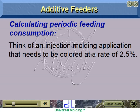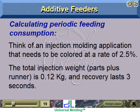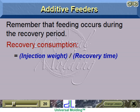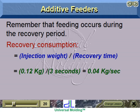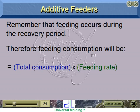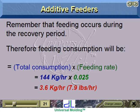Calculating periodic feeding consumption: think of an injection molding application that needs to be colored at 2.5%. The total injection weight, parts plus runner, is 0.12 kg, and recovery lasts 3 seconds. Feeding occurs during the recovery period. Recovery consumption equals injection weight divided by recovery time: 0.12 kg ÷ 3 seconds = 0.04 kg/sec, or 144 kg per hour, or 317 pounds per hour. Therefore, feeding consumption equals 144 kg/hr × 0.025 = 3.6 kg per hour, or 7.9 pounds per hour.